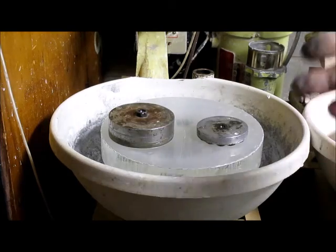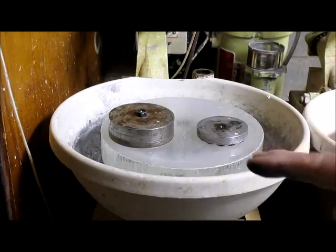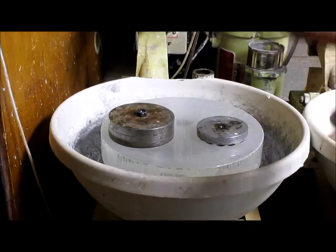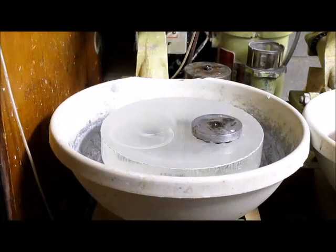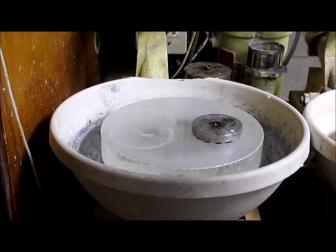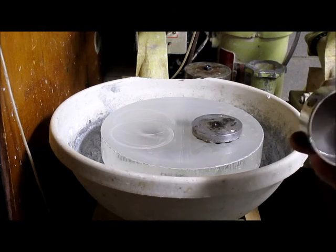That's the reason a diamond wheel may slow down — the surface starts getting smoother and smoother and it actually quits working. So what you want to do is keep the surface rough. You could use some coarse grit with steel to rough up the surface.